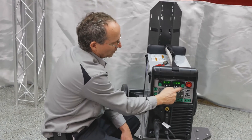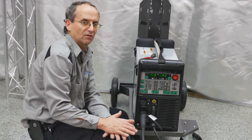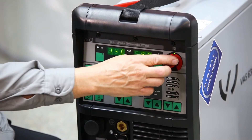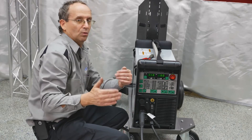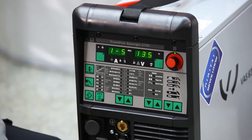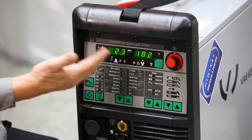This is a big control on your gun for when you start and when you end your weld, because you can custom-set your settings. If you think your hot start isn't hot enough, take that 135% and bump it up to 150 and try that. If your ending seems a little too cold, bump it up to 60 or 65. There are only three items in this menu and it just cycles around. That's how you adjust your hot start and your cold ending. Hit the store button again to exit back to the main screen.